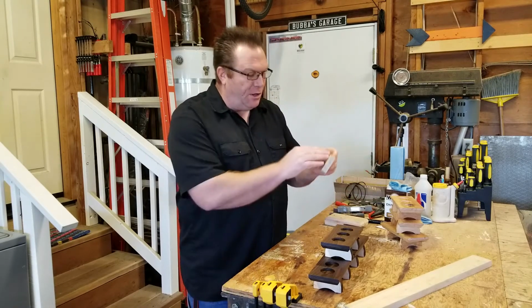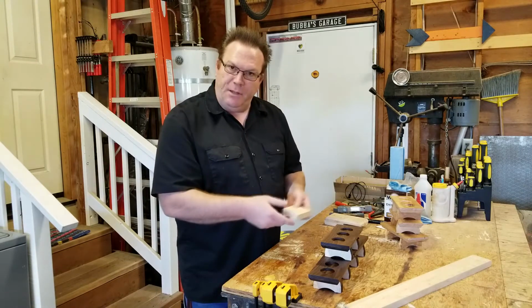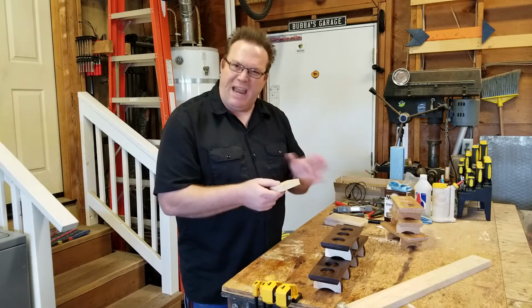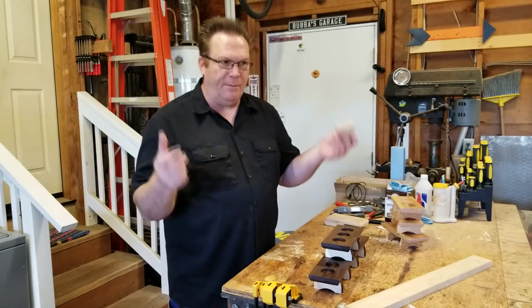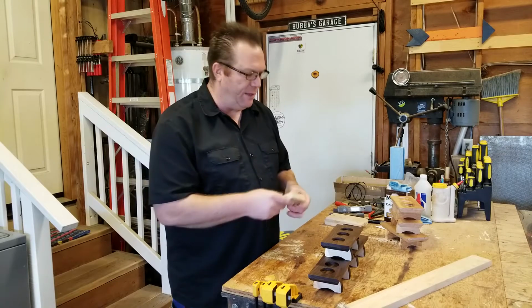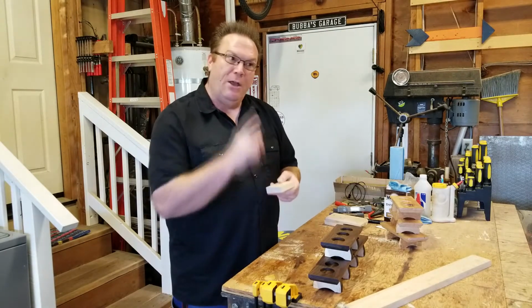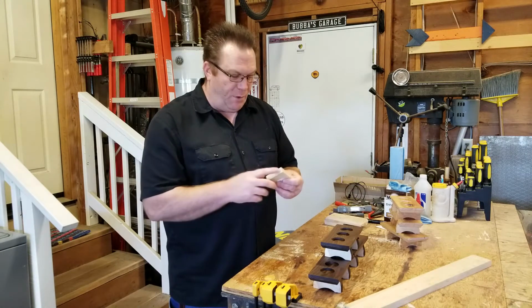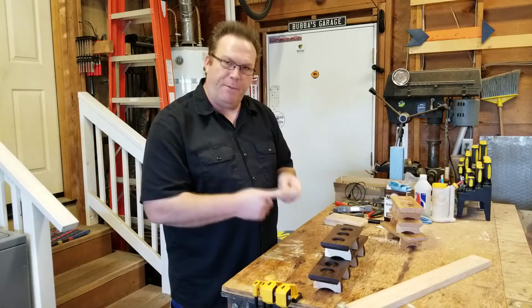When I was carving the feet out and shaping them, I cut them first on the bandsaw, and I figured that way I could just sand right to the line. Piece of cake. Well, I am assuming, because I'm not real experienced using maple, and primarily because the part I was sanding was mostly the end grain, on my disc sander, it burned it so bad, it left a pretty pronounced mark, at least on the most flat part of it.